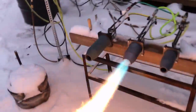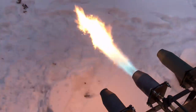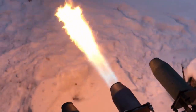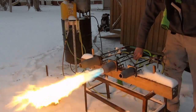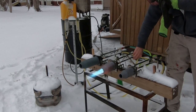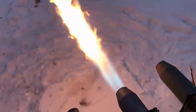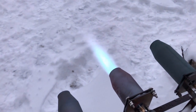It does take a little bit of air, but you get this nice stiff flame. The wind is blowing about 10 miles an hour — freezing cold wind — so it is kind of messing up the stability of that flame a bit. Don't let that mess with you, but it's got a much stiffer flame in a nice wind-free environment. So I'm going to turn this thing back down. I just turned down the fuel and left the air the same. This is a more ideal setting right here — a true high velocity flame, because we've got just a little bit of fuel with a whole lot of air.